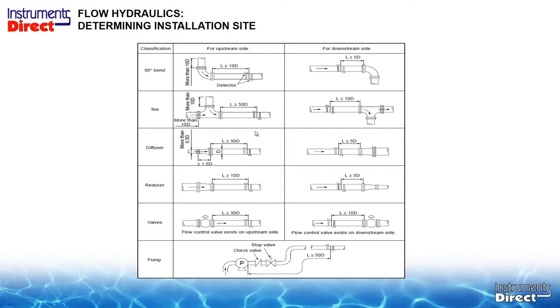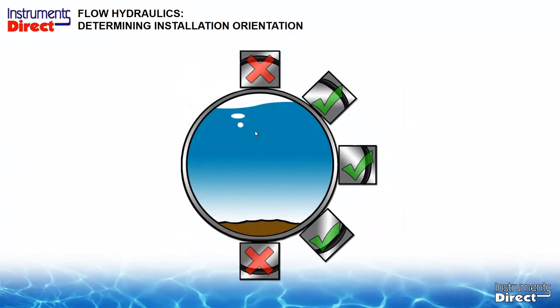When installing the flow meter, flow hydraulics also play a role in transducer placement. The pipe must be full. If you have a choice of where to install a transducer on horizontal pipe, 12 o'clock and 6 o'clock are probably not the best locations — from 1 to 5 o'clock is probably the best location on the side. Vertical pipe really doesn't make much difference.